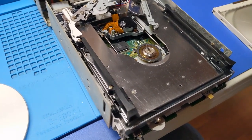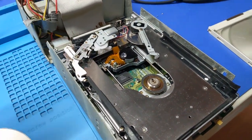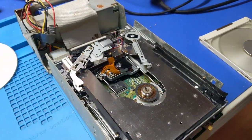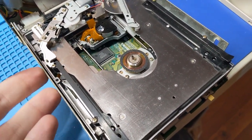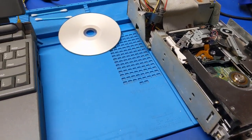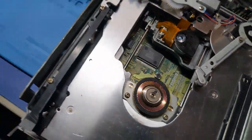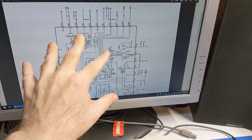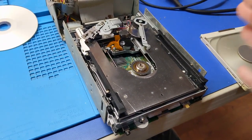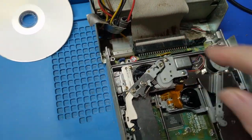I've been tinkering with this thing for maybe two or three hours. I was even adjusting the laser power level a little bit and wasn't really getting a whole lot of change, so I've set it back — had to turn it up a hair, but it's pretty much where it was before. Turns out I was adjusting the servo settings underneath, which was not that hard to do because there is no service manual for that drive. But there is a data sheet, which tells you what all the settings are. With the process of elimination, I was able to tweak the servo, and it improved, but it wasn't doing a whole lot.